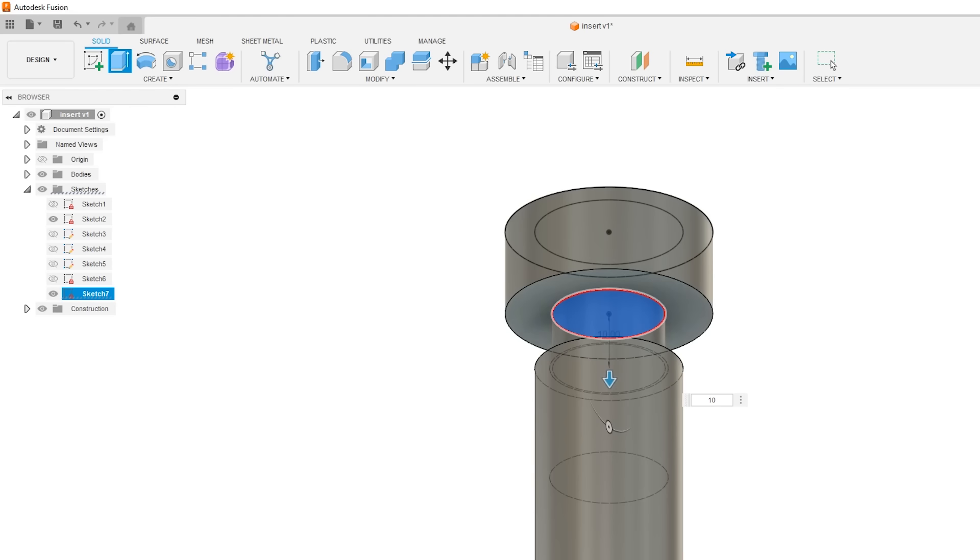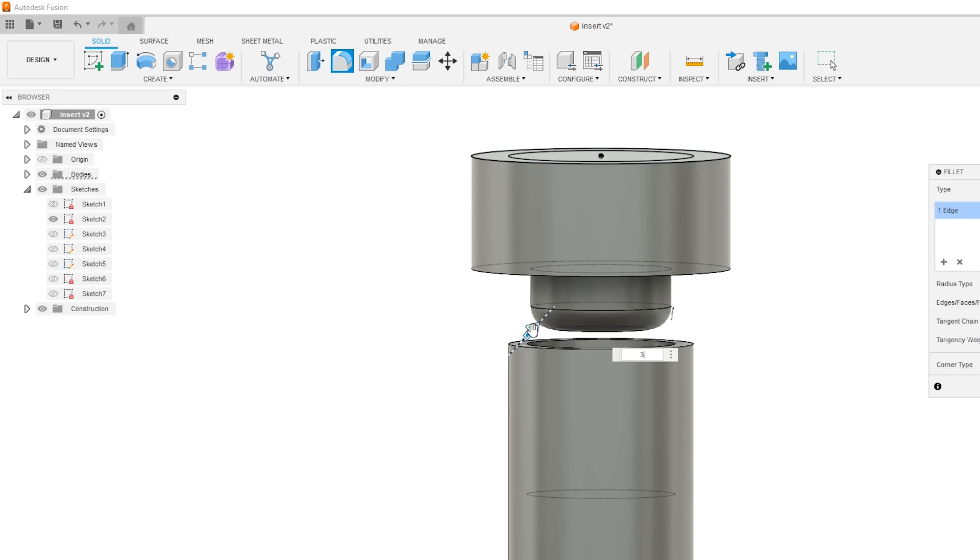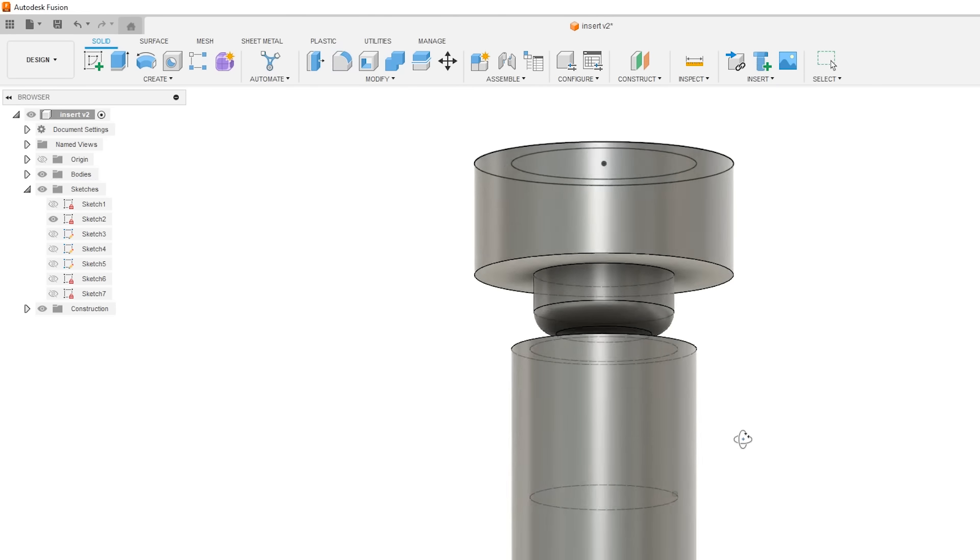Most people believe that the cap should attach to the outside of the part, but that's not always true. Sometimes you can make a lid that's a plug, and with plugs you follow the exact same rules: a very slight chamfer to the outside of the plug so that you have a good interference fit, and if you want to reduce the amount of surface contact you can change the geometries a little bit. And of course chamfer and fillet everything.